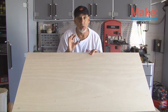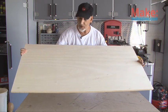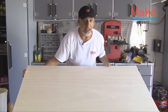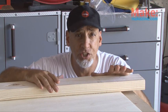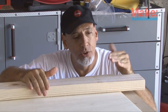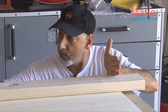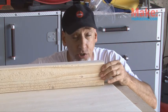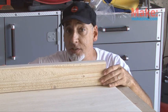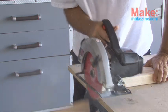All we have to do now is start with the base, and those are made out of two by fours. I'm going to look at the best side of this because I want the best side up. Now, the small dimension of a two by four — the two — is not really two inches; it's closer to one and a half inches. Our length of our board is 48 inches. We're going to have two smaller pieces on both ends of our long support, so that equals a total of three inches — one and a half times two. Three inches subtracted from 48 gives us 45 inches, so that's how long we need to cut two of our two by fours. For the end pieces, we need two that are exactly 24 inches in length.